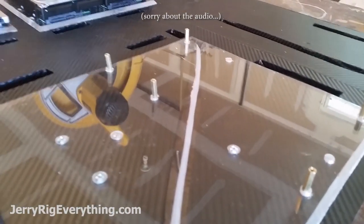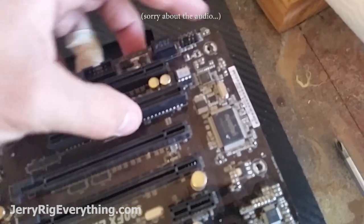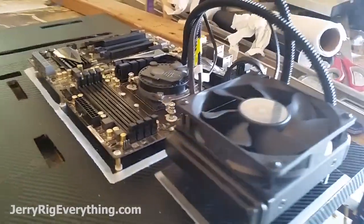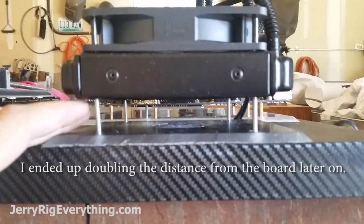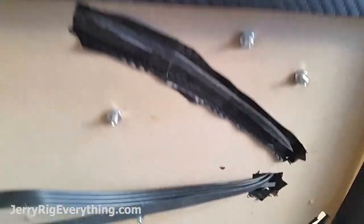This is the motherboard mount. I have one inch standoffs sticking out — three of them are replaced by normal screws that go through and hold the motherboard to the mount itself. All the standoffs have their own little screws and the other two screws come all the way through, leaving a small gap where you can see some light shining through. The CPU fan is mounted similarly — screws coming up from the bottom of the plastic piece, plus three more screws coming through the back, with the same V-shaped slit in the plastic to help disperse the light.